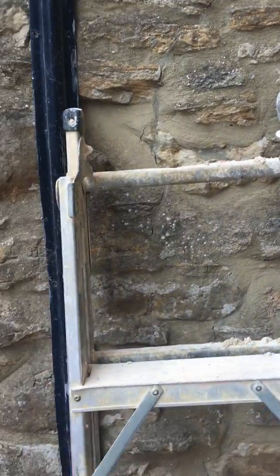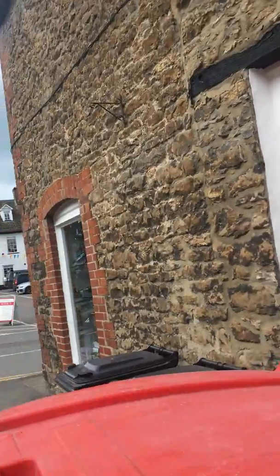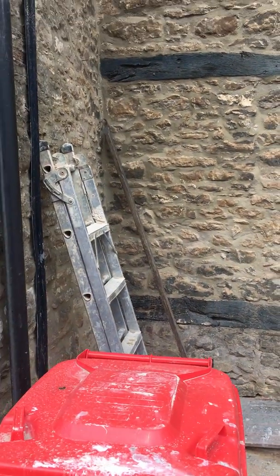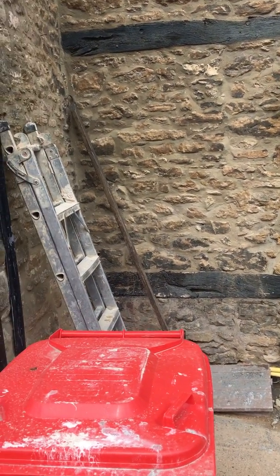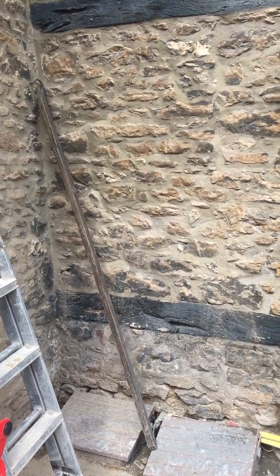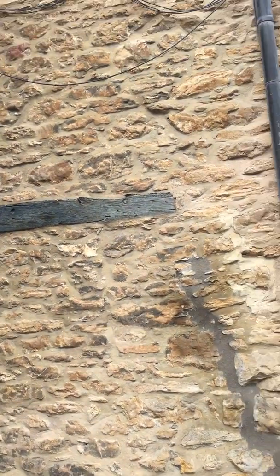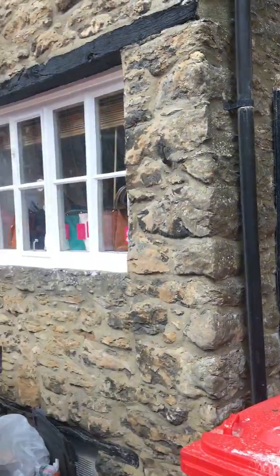It's just gray and horrible, cracking all over the place. It's not so much to do with ground movement — it's to do with the stone heating up and then cooling down. That's what creates the cracks. You then get moisture which enters through the cracks and it doesn't leave — it just sits there waiting and rotting your stone. The mortar rots as well, so the whole thing falls apart. If you want to rot a building, by all means use a cement mortar.